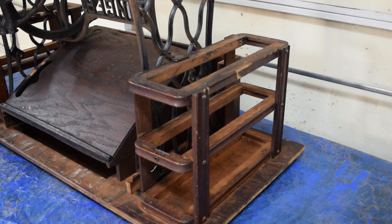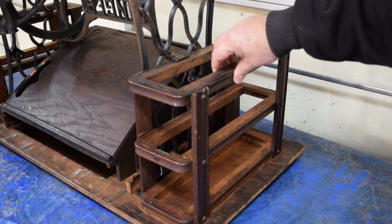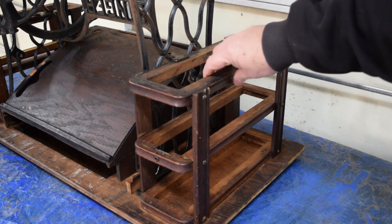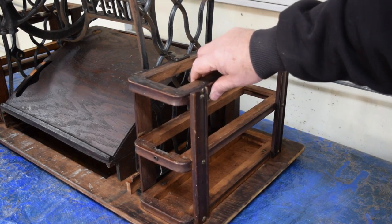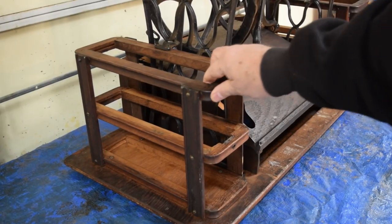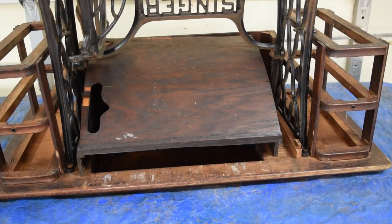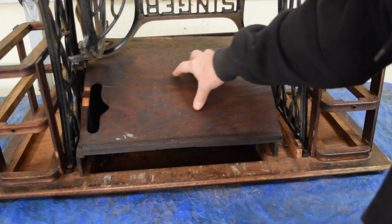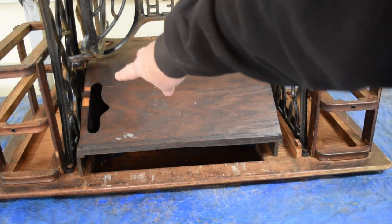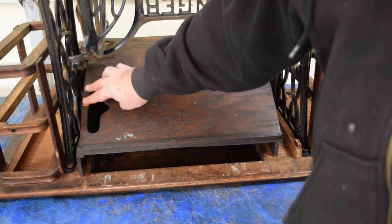And with our old girl upside down, you can see our first issue is that this drawer case, obviously it's not only loose in its mounting, it's completely loose and needs to be reassembled. Let's check the other one. Yeah, pretty much the same issue with this one as well. The front part of the cradle looks to be in pretty good shape. We have a couple of pieces of missing veneer here that we can take care of.